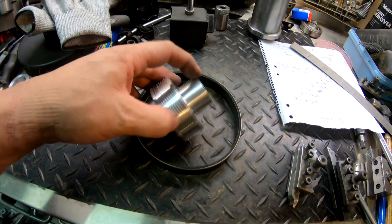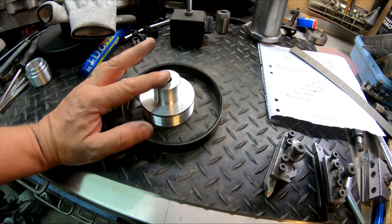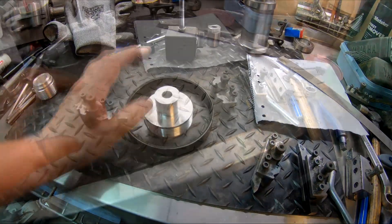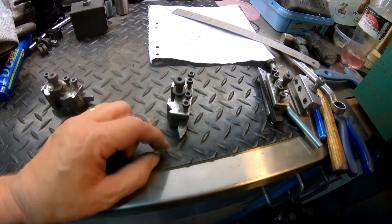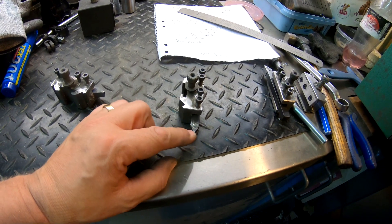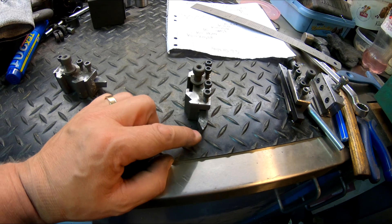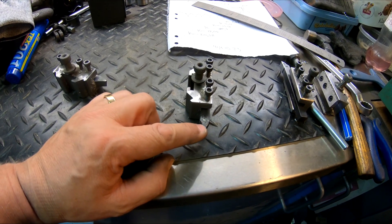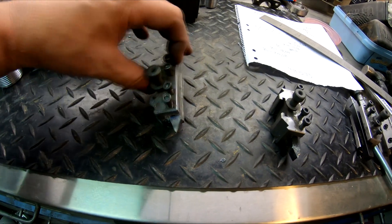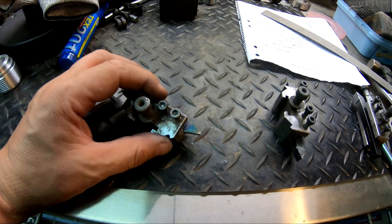I need to make this one shorter, but that's first when I know exactly the height compared to that one and how this will be mounted on the motor. For the first pulley I used this tool, but after I measured it, it was not really correct - this one has a tip of 55 degrees, and for the pulley and the V-belt that I am using it needs to be 40 degrees. So I made this special one where I sharpened the tip and made it 40 degrees.